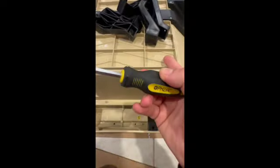Another tip: I like to use these little reinforcements, so this gets more structural integrity. I like to use them to hold my screws. Now we're going to put this final piece in, screw it nice and tight till it feels nice and snug, but not over tighten it. There we go, it's nice and tight, done.